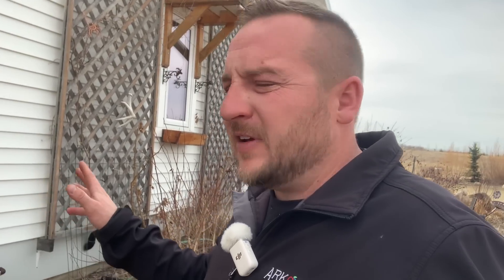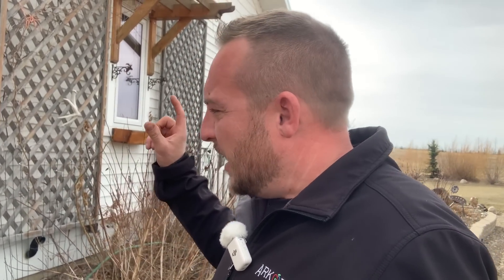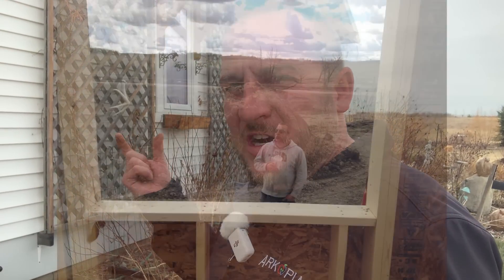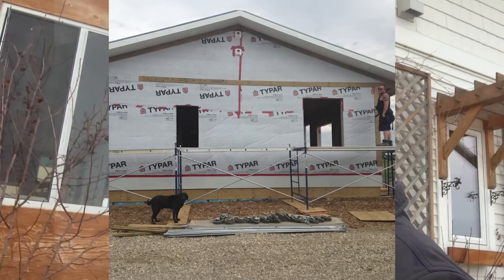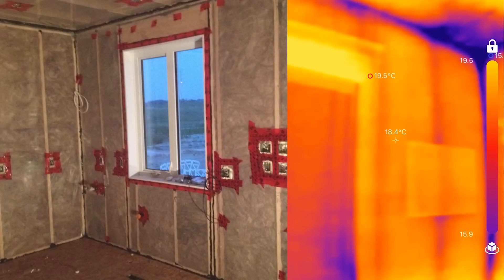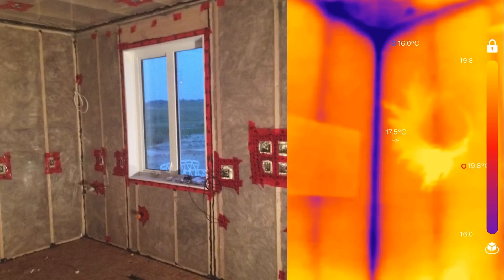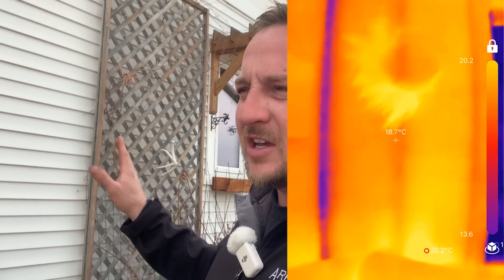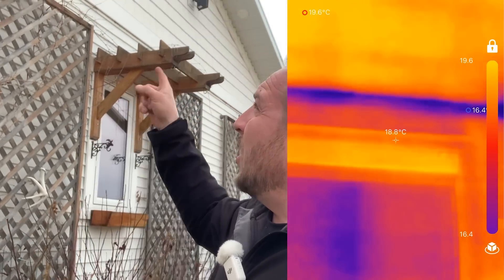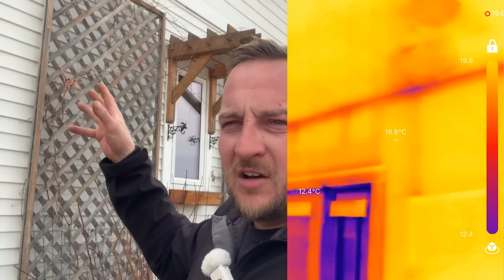My house that I built for myself is small but very, very efficient. It's two-by-six construction with an inch-and-a-half of rigid on the outside for a total R-value of just under 30. In the attic I have a four-foot overhang on the north and the south, which allows me to get a lot of blown-in insulation over there. Even so, taking the thermal imager inside I'm able to see the thermal bridging on the studs. Where you put two studs together it's called frame caulking — you put acoustical sealant to prevent drafts. I built this myself and took my time; it's about as good as you can get with two-by-six construction and rigid on the outside, but you can still see the cold spots on the top of the wall and thermal bridging on all of the studs.